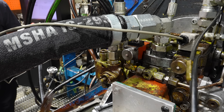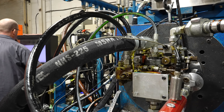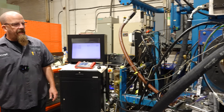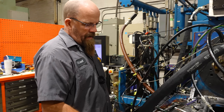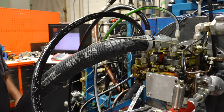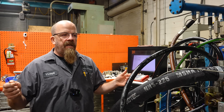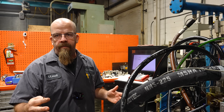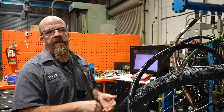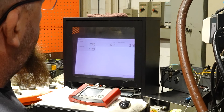Let me run it on the bench to show you. I've got my electrical signal going to it now. This inching valve is a throttle control — if the customer wants to go inside a barn he doesn't want to go real fast, so he can set it to inch along real slow. But if he's got to go from field A to field B two miles down the road, he can open it wide open and get full flow. By varying the position of this I can vary my flow.